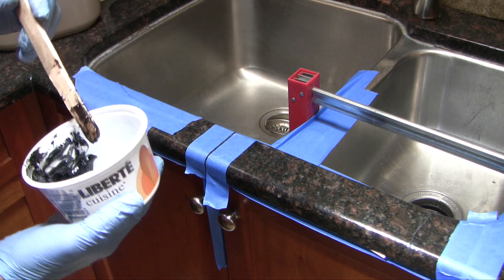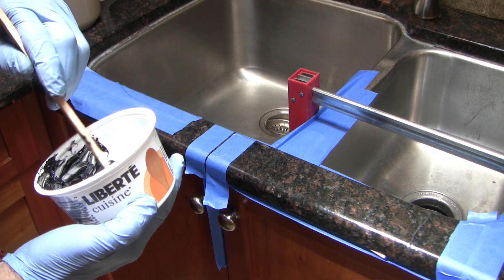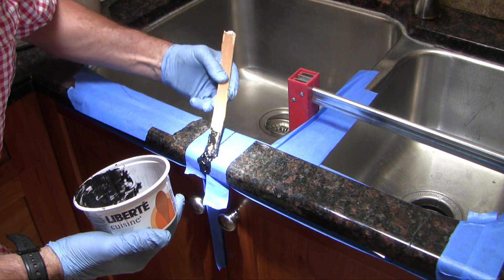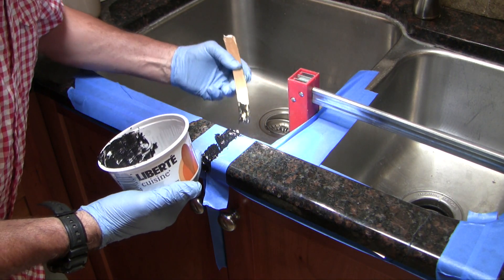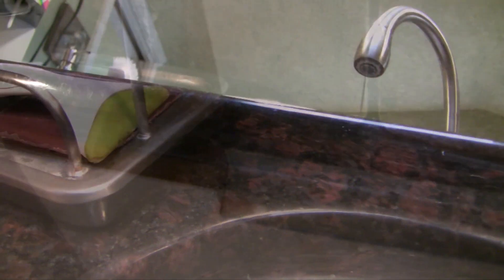That's going to be more difficult on the other side, but in any case I didn't record the next step, which was to carefully razor off all the old silicone from the sink and refresh the silicone that holds the slab in place. You can see that silicone sealer is being used not only as a barrier to water but also to hold the granite to the underlying countertop. By using sealant it allows some movement of the underlying wood due to moisture and settling without causing strain on the overlying granite. I'm also using silicone sealer to hold the granite to the underlying stainless angle iron.